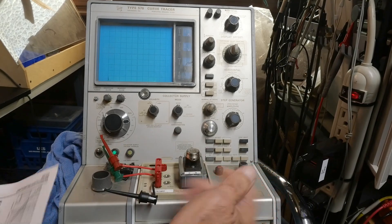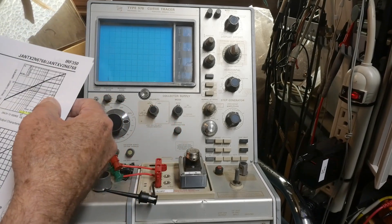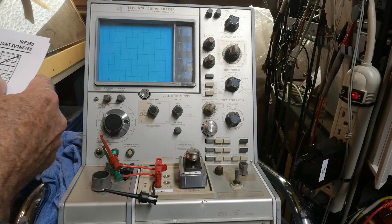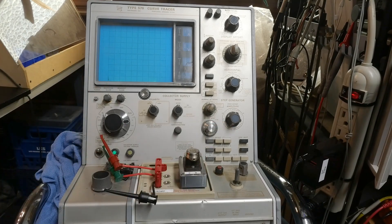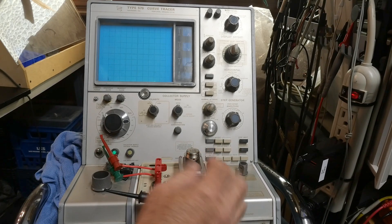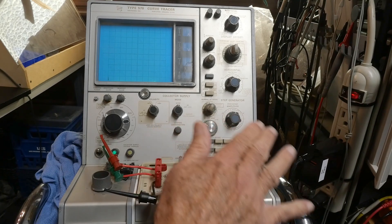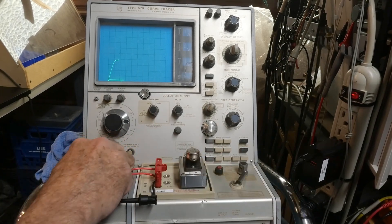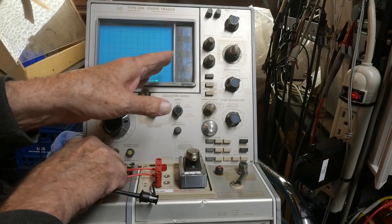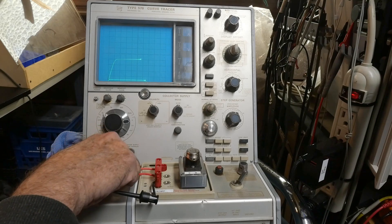It's getting hot — no heat sink, that's the deal. So using the lower voltage setting, the five-volt line is going to be around seven amps. It's just because I don't have a heat sink. That's one of the problems with these TO3 parts — it's hard to put a TO3 heat sink on the curve tracer. That's why the curve was bending up on us: we're going along and then it starts to bend up when it's starting to get hot. But anyway, it's acting as a FET. There you go.